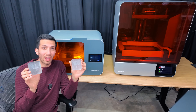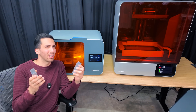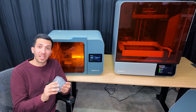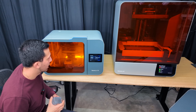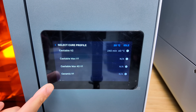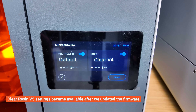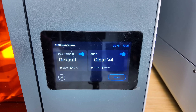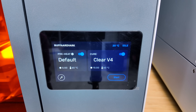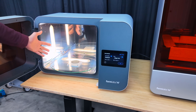In my hands I have the two mold halves which were washed and allowed to air dry, and they feel very dry and solid — unlike cheaper resins that come out feeling a little more tacky. We do have to cure them to make them harder and usable as final parts. On the cure station screen we select the resin material: I couldn't find clear V5 so I selected clear V4, which should be sufficient. It's going to cure for 15 minutes at 60 degrees Celsius with a preheat, and I'll leave it at the manufacturer settings.